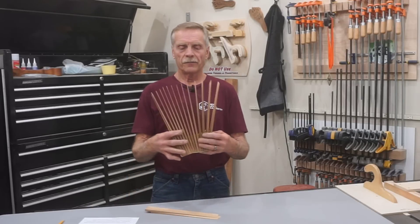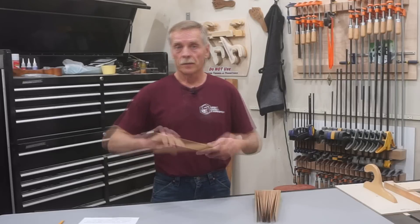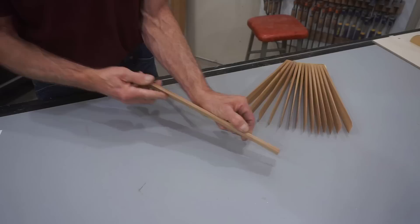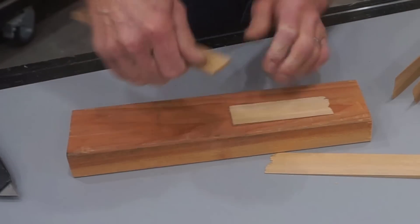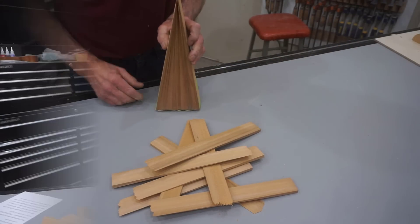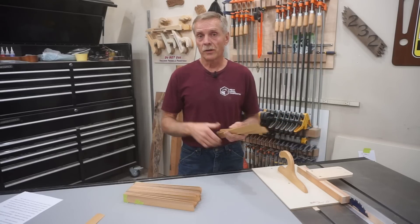First off, they have to have feather-thin points, which allows me to make very small, precise adjustments for things like cabinet installations, because the thin tapered ends start out at a sixteenth of an inch or less. I want my shims to be smooth and relatively knot-free to slide and adjust smoothly and not break easily in use. And I want shims to have straight, consistent grain so they cut and snap easily. They need to be fast and easy to make — practical to use without hesitation from concern for cost. Most importantly, I need to make these quickly and safely, because there's no shim in the world worth the risk of injury or a trip to the ER.